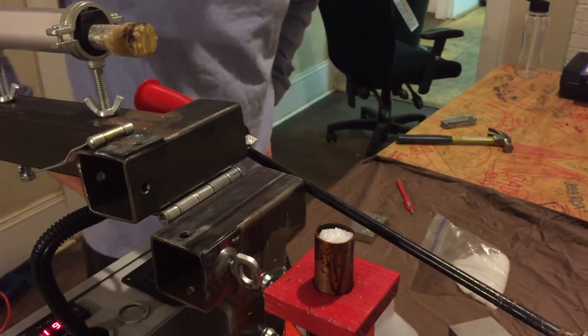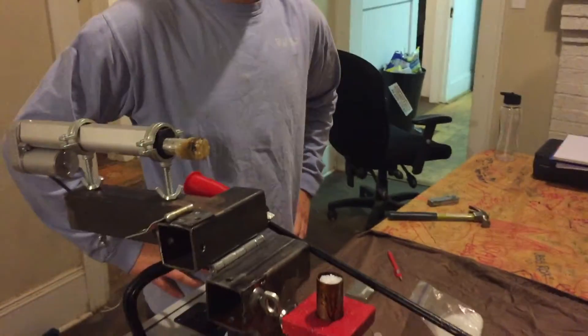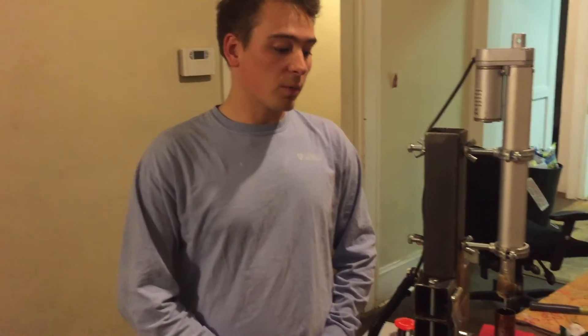So we'll let that have some melt time — usually 10 minutes. We've given the machine about 10 minutes to ensure that all the plastic is melted, and we're going to begin injection.